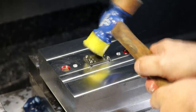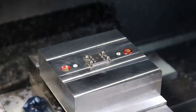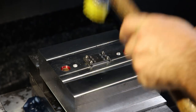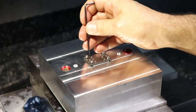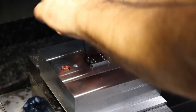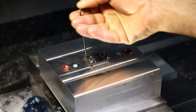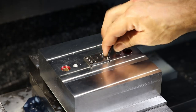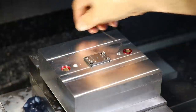Okay, so now the screws are starting to become proud. Okay. I think we are bottomed. So now we'll go in and screw this guy down. And I have equal amounts of metric and English screws or hex keys, which can be a source of continual delay and frustration. I'm going to screw this down like it's a head on an engine or something. Kind of cross screwing, or cross tightening.